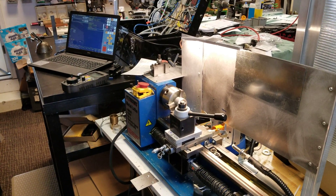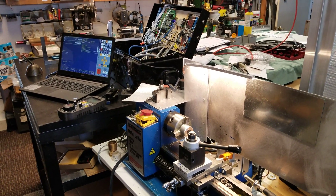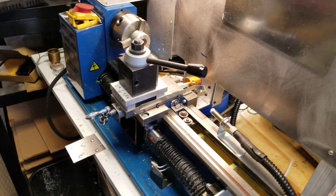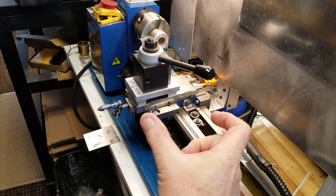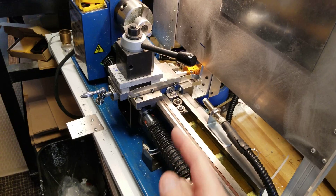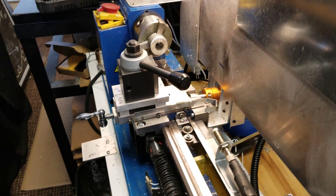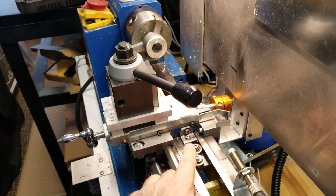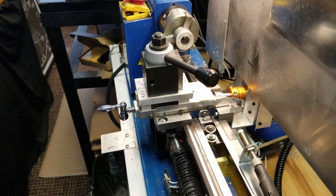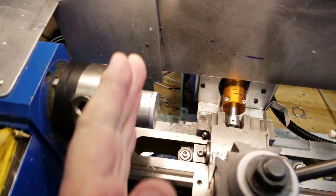Hi, this is David Munson. I've got a mini lathe running with Centroid Acorn. I've got a wireless controller over there, and I was having some problems with the carriage — the saddle was twisting when the ball screw would push and pull it, and I could never get the Gibbs set up quite right. So I was looking at Steve Jordan's video on how he built this plate that runs underneath to keep it from lifting, but I was still having problems with the motion twisting like this.